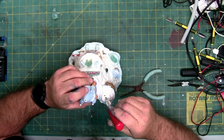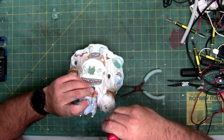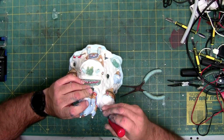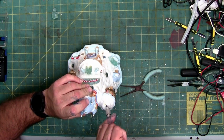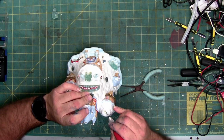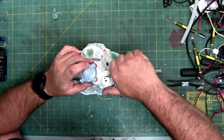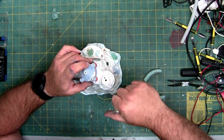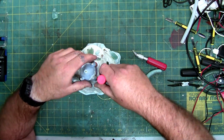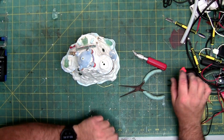All right, now I can clean out the hole real quick so I can push the new one back in before this hardens. So it is a type of hot glue they're using. Gets really, really, really pliable with that heat gun. Again, I have it set for 150 Celsius. So if you get a heat gun that has a variable adjustment, you can start at that or maybe a little lower if you don't feel comfortable. Let's see. Just make sure that the... There we go. Want to make sure the hole's clear for feeding this back through.